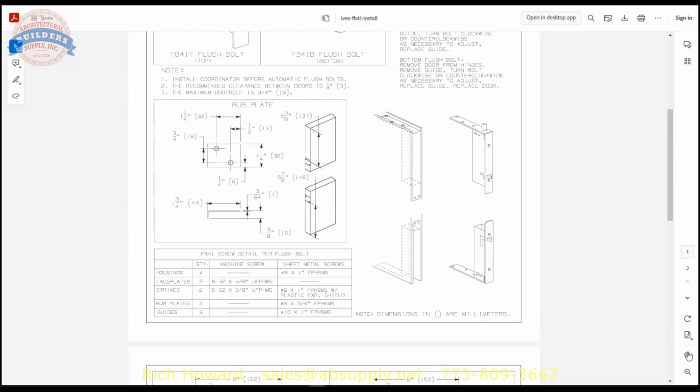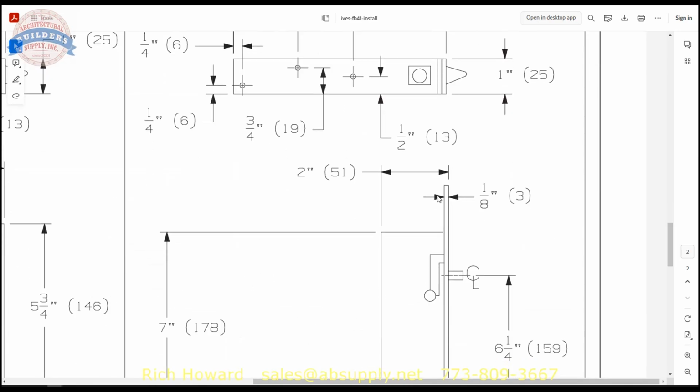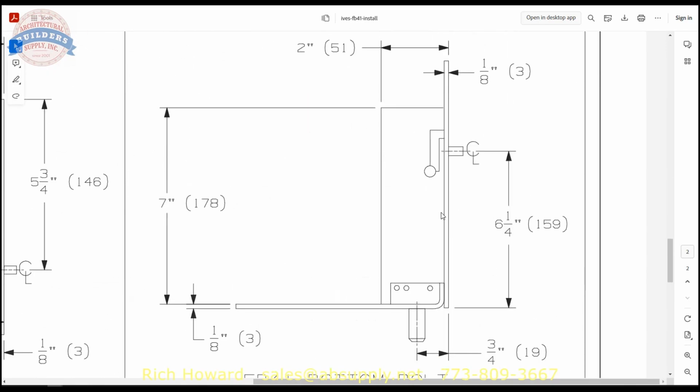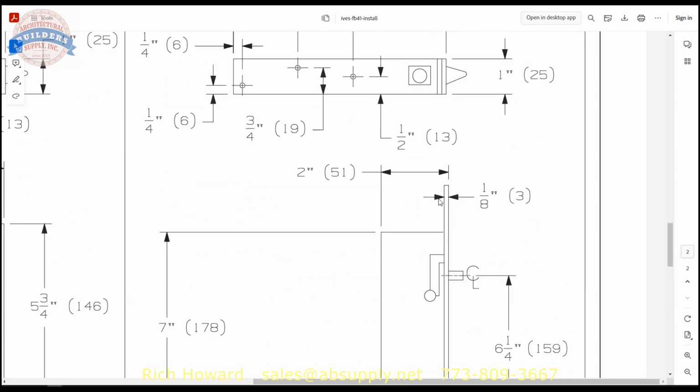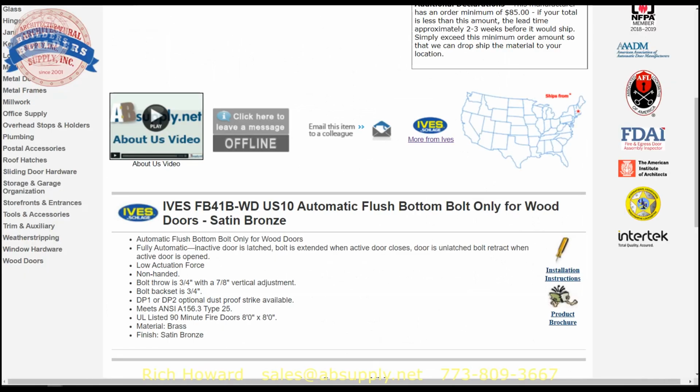So Major has it right in the sense of, when you do the faceplate, you're doing the entire faceplate, all of this. When you're doing the body with the template installed, the top template, that will achieve just this prep here. And we can verify that because we can see that it's 1/8 of an inch on the bottom or top, and then it's an 1/8 of an inch on the face. So you're going to have a router set to 1/8 of an inch, and you're just going to make that happen. Easy stuff.